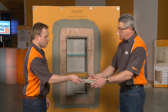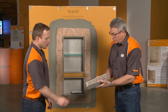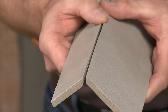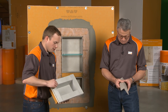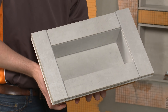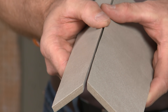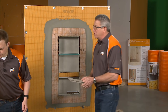The second option is using two pieces of tile with a saw that allows you to miter — do a 45° cut and set that into place. We have one that's pre-assembled and mitered, and even on this very dense tile you can see a few little chips on that edge. So that is an option, no doubt, but the option we really want to focus on here is using the profiles.